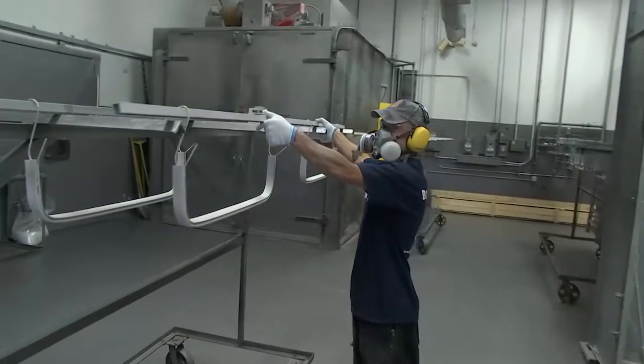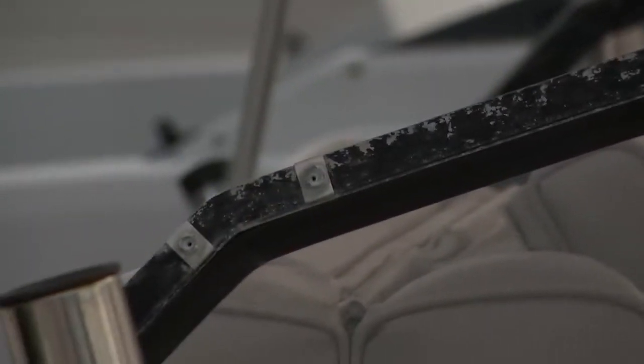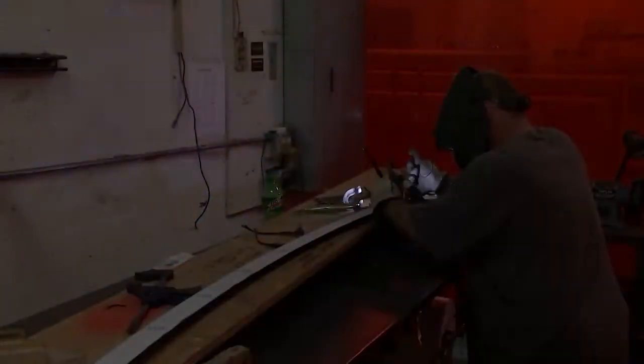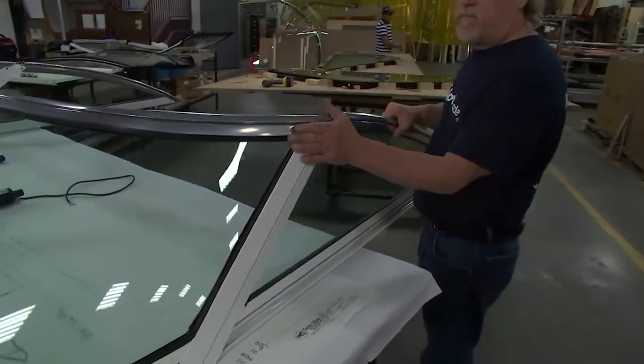Canvas shops back in the day would take the stainless steel snap stud for canvas and self-tap it right into an aluminum windshield. If you look real close and you have that on your windshield frame, you're probably going to notice some pitting — if not a dish where material has actually evaporated. That's right. Is there a way to refurbish that or do you have to get a new replacement part? We can bring the windshield back, touch up those holes with a little weld and then refinish, or if it's too bad we'll just switch out the top trim — the whole top section.